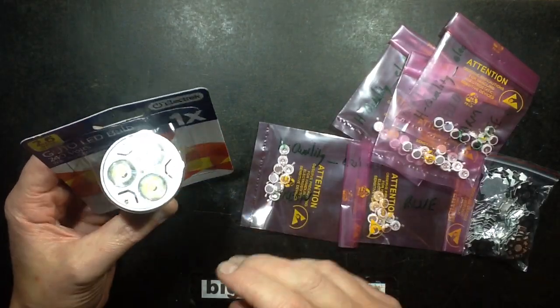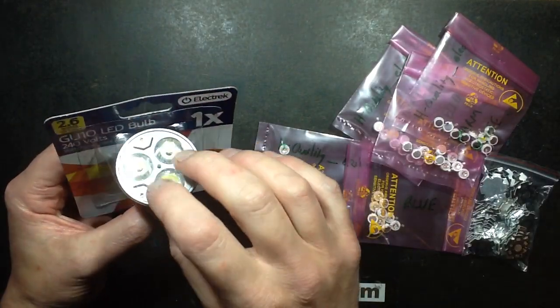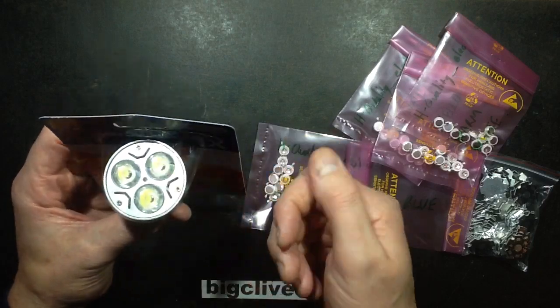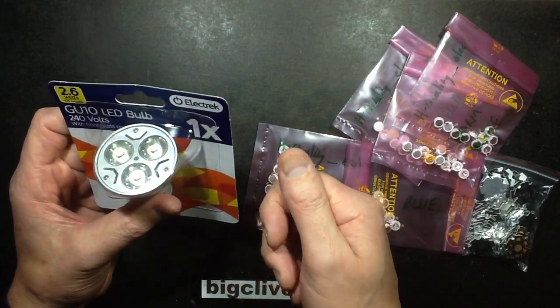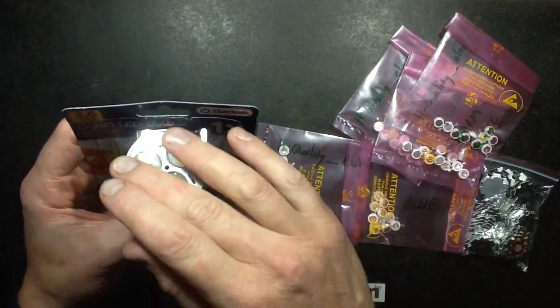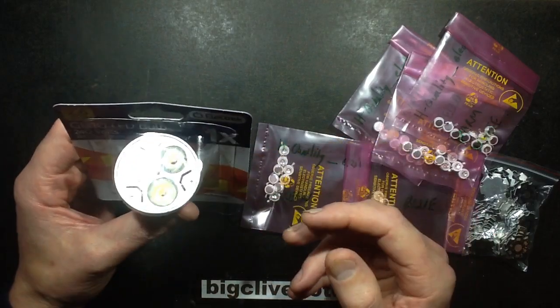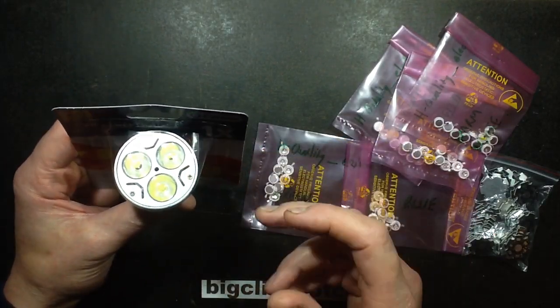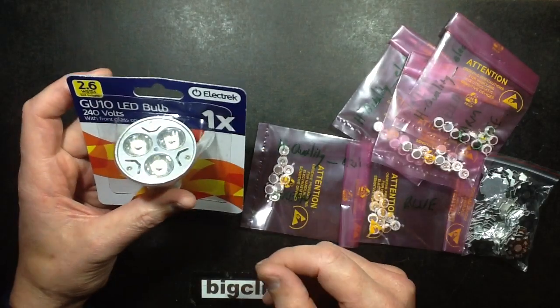You can get the hydroponic ones, which have like 2 red and 1 blue, I think it is, and you can get the RGB colour changing ones, but they don't tend to spread the light out so much, because if you want cyan, for instance, the red one won't light, so the light will bias to one side, and they won't tend to operate at the full power of the fixture.